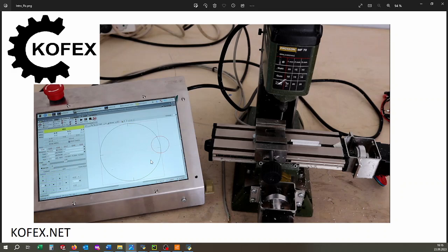All in all I'm very happy with the script and the milling results it produces. I'm able to really produce some pretty accurate parts with the milling machine, which wasn't able to do this before. For example, I made a motor mount for a model airplane and this backlash was driving me crazy — it was not possible to make precision parts. But with the backlash compensation it really is possible. I have added the script to my controller and I will also make it available for download.